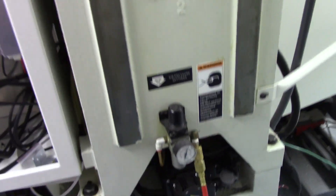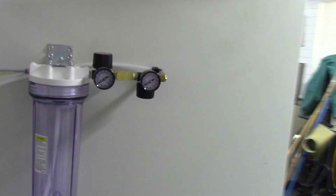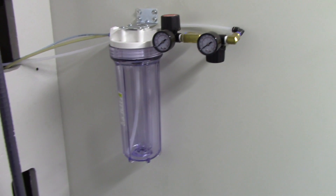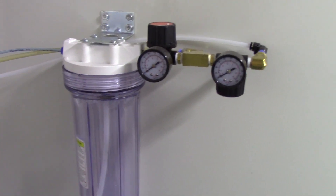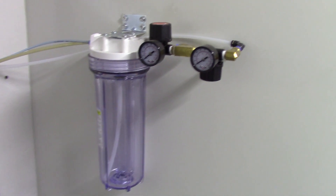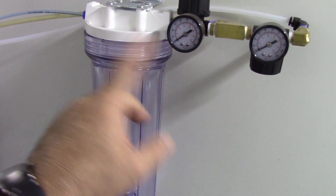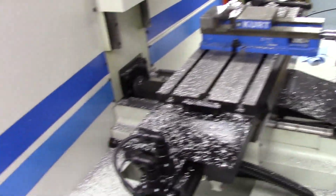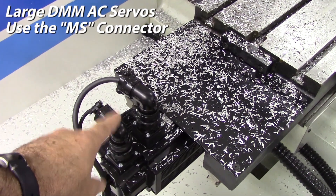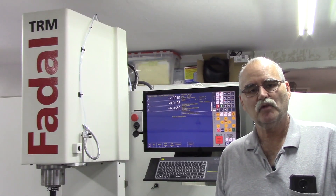There are the Y-axis and Z-axis servos. This machine had a nozzle for a misting system but the tank was gone, so I added a household water filter canister with two regulators: one to regulate pressure in the canister — about 10 PSI is good for the fluid — and the other to regulate the air blast to the nozzle. There's the X-axis servo. Because that table travels through the saddle, those connectors had to be placed upward. Currently DMM Technologies has no solution for these MS military-spec connectors.